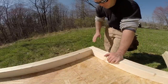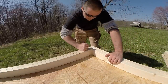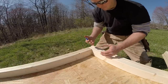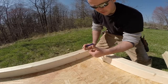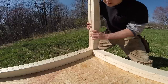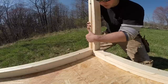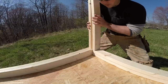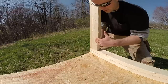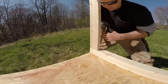When I'm framing this wall, this end is going to be a corner — it's just going to have a stud on the end of it. What I mean by corner is that when I stand this wall up, I'm going to need backing — something to nail trim to on the inside of the wall. I could place one stud and another stud with an inch and a half gap in between, but when I'm running my electrical it's very difficult to get through there. So instead I'm going to turn this piece of wood sideways — that will give me backing on the inside to nail my trim to, and it will also allow my electrical wires to run through there easily.